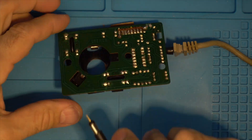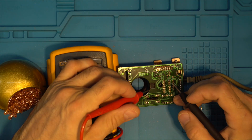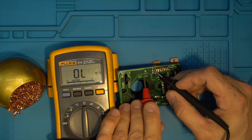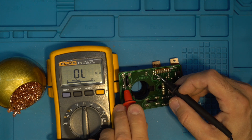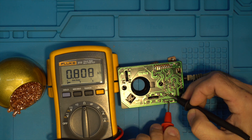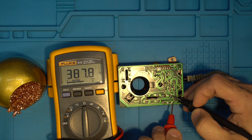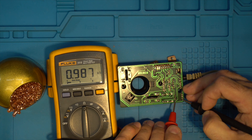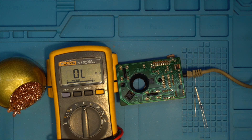The last one is about 248 millivolts. So those are the values for this board. Right now the X-axis works but the up and down is choppy. Let's look at the different voltages and try to improve this. I have already changed one resistor to about 2k and it improved the signal significantly. This one is about 800 ohms, this one is about 390 ohms, and the last one is about 1k. I'm going to replace all of them to a 2k resistor and see what we get for voltages.